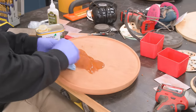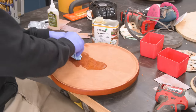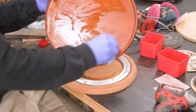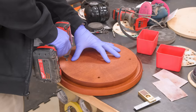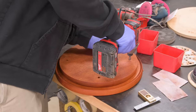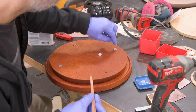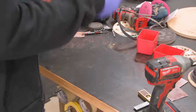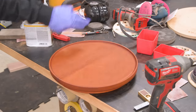The hole should only be large enough for the screw head to clear. So now I'll apply the finish — just a little hard wax oil should do the trick. Now with the finish applied, I can attach the top. The holes on the bottom really aren't hurting anything, but I decided it would be good to make use of them by attaching some little rubber feet that should help stabilize the Lazy Susan while helping it grip whatever surface it sits on.